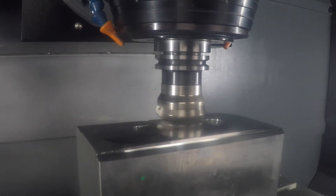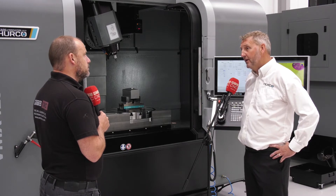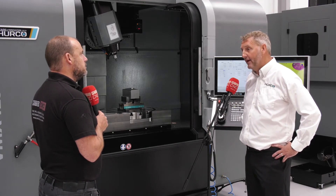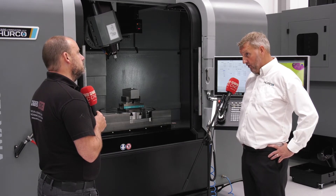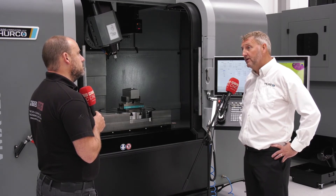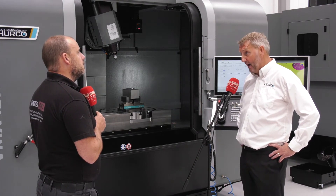What about the performance on the milling head? It's an inline motor, 12,000 RPM as standard. We can offer 18,000 RPM with HSK 63 as well. The rotary option gives 184 degrees of movement so you can undercut on work if need be. It's full simultaneous and positional.